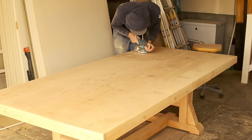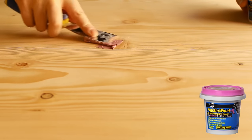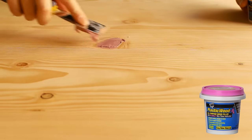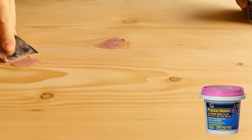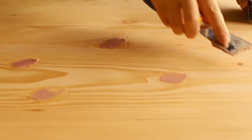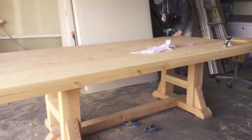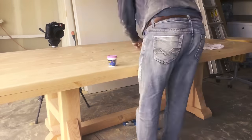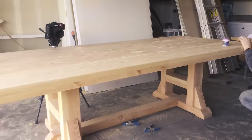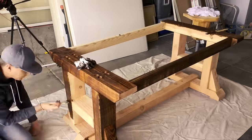Finish all of the sanding and then you're ready to use some wood filler. I use this Plastic Wood X — it's an all-purpose wood filler and it's pretty cool for a couple of reasons. Number one, it goes on pink and then dries more of a natural color so you can see when it's dry. Number two, it's a stainable wood filler so it actually matches pretty much whatever type of wood you use with it, especially with Douglas fir or pine — it matches really quite nicely. Make your way around the table and using a putty knife, use the wood filler to fill any gaps, cracks, knots, or anything that would prevent the table from being smooth and even. Once filled and the wood putty has dried, use 220 or 120 grit sandpaper to smooth it off again and make sure you finish with a 220.